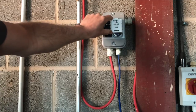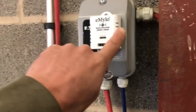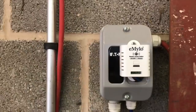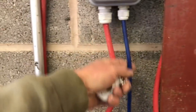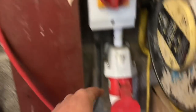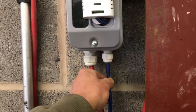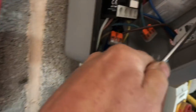I discovered that this would actually sit on the top with the wires inside. I've put a link for both these units — this is the remote unit, and this is the contactor or three-phase starter. What happens is this here is a 240-volt plug, just to regular mains. This here is the three-phase outlet. And this is my shop three-phase.